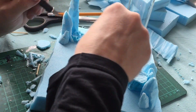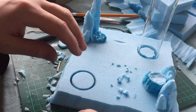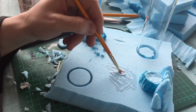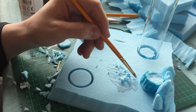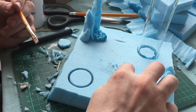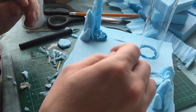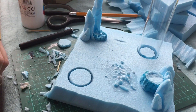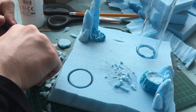In terms of the acrylic stand measurements: the acrylic rod was 500 millimetres in length, and in the middle of that was 250 millimetres. Either side of that 250-millimetre midpoint I moved 30 millimetres left and 30 millimetres right and made a bend upwards — so you've got a U-shape with a straight line in the middle. Then I went up another 5 to 6 centimetres and bent the rod to the left. Then up another 5 centimetres on the right and bent it to the right. Then another 5 to 6 centimetres either side and bent the rods forward, giving you that armrest shape.